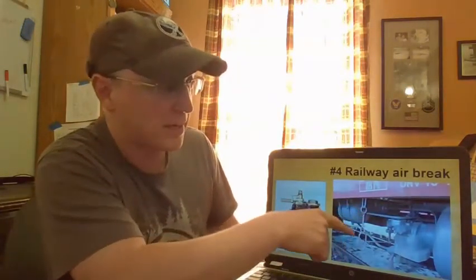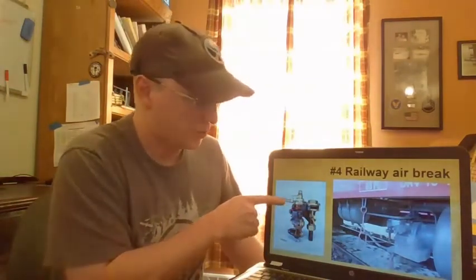The way they work is simple. On the bottom of every train car is a pressurized air tank and a hose that goes down to the brakes and eventually connects to some type of an air compressor. When the engineer wants to release the brakes, he or she increases the pressure by opening up the valve. Increasing the pressure tends to open the brakes and allow the train to roll. When you want the train to stop again, you decrease the pressure in the system, thus activating the brakes and slowing the train down.